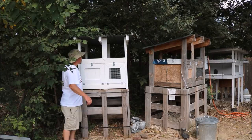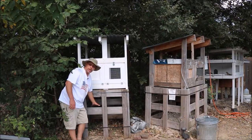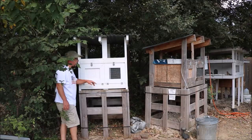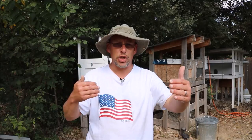I got the roof mounted on there and got it mounted on the pedestal. I'm going to come back through with my skill saw and cut this open right underneath so I can get in there and shovel the droppings out when I clean it. Other than that, it's pretty much done. The only thing left is to add a watering system, similar to my other hutches. Hopefully this video helped you out. I didn't give specific measurements since it depends on what you're standing it on. If you're building from scratch with legs, I'd recommend going 36 or 24 inches wide to match hardware cloth sizes. Thank you so much for watching, and as always, God bless.